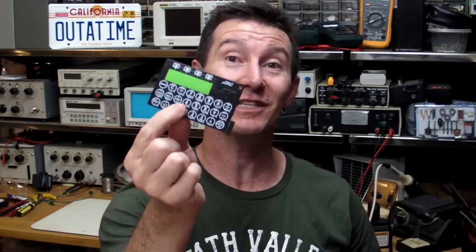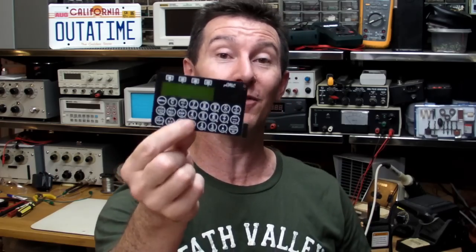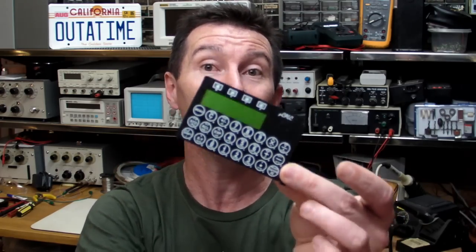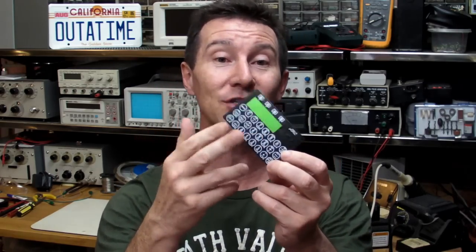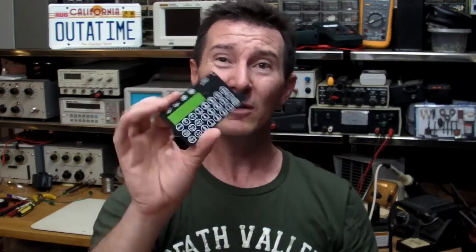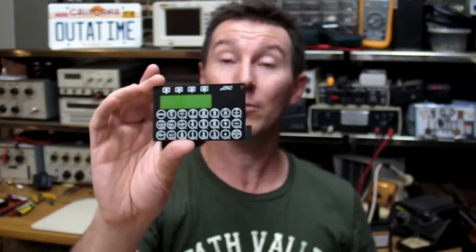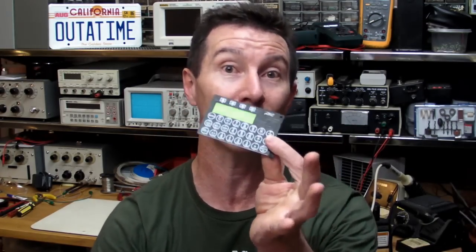So that's the MicroCalc — the world's first and only credit card sized scientific programmable calculator slash computer with dot matrix LCD. It's ahead of anything that's ever been developed or put on the market before, and it was really simple. It just uses a few novel concepts: capacitive touch sensing, novel sandwich construction using the front panels as PCBs, the back panels, and the inner core. A pretty awesome-looking product, incredibly simply achieved. I'm a big fan of using PCBs for front panels like this — a lot of my projects do it and I highly recommend you give it some thought next time. See ya!